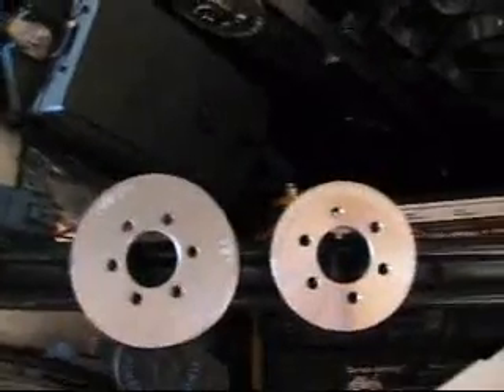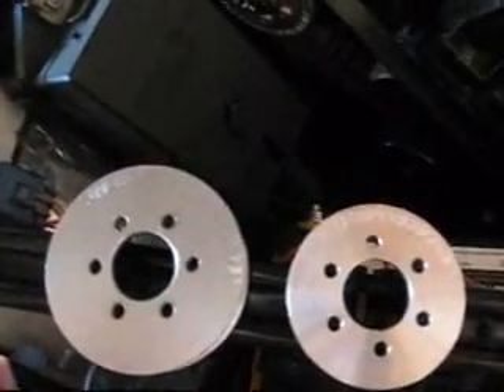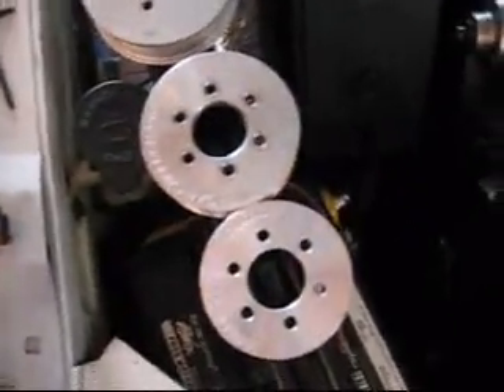The key is when buying a modular system, pick one that has a lot of sizes available. That way you have a lot of choices and you could experiment with more sizes. When you're pulling the pulley off, just leave the belt on — that way the pulley won't roll around when you use this to take it off. Here's the pulley removed and here's the hub. Here's the little screw holes. Once you get the pulley off it's just a matter of sliding in which pulley you want to put on.